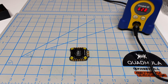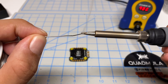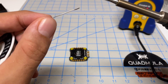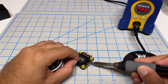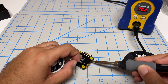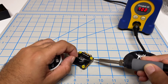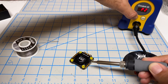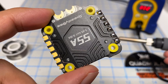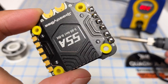We can see it's heating up pretty quickly. With this being a brand new tip, I want to get some solder on there to make sure the solder will stick properly — initially it wasn't sticking, which is fine for a brand new tip. Now we can see it's sticking on there nicely. I should really be using a bigger tip since this one is quite small and better suited for a flight controller. The temperature is staying at 700. Let's go up to 802 — at 800 degrees that's soldered very nicely. The solder does help with heat transfer, so get a bit on the tip, heat up the pad, and add some solder to it.